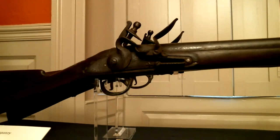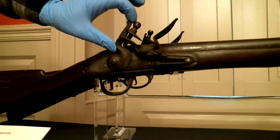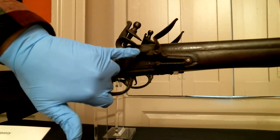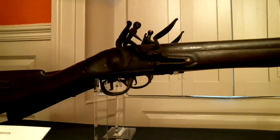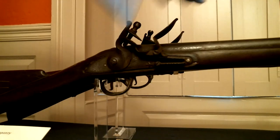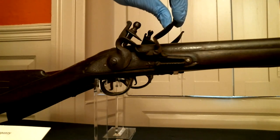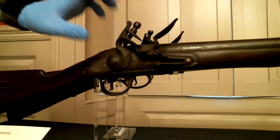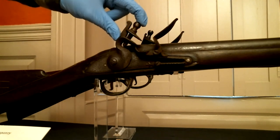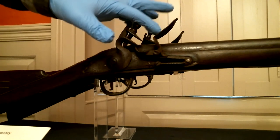A flintlock system involves a piece of flint stuck between the jaws right here that are connected to this hammer. To fire a musket, you would first need to put a small amount of measured gunpowder into the pan right here. You would then clamp down this piece of steel called a frizzen, which would cover the pan, protecting it from weather conditions and as you move the rifle to load ammunition. The hammer would then be pulled all the way back to fully cock it. Usually the hammer would have a piece of flint in the jaws; however, this particular model does not, as it's missing. Pulling the trigger would spring the flint forward towards the pan, sparking against the steel of the frizzen and igniting the gunpowder.